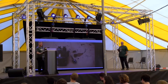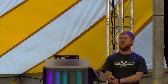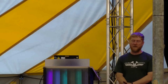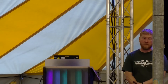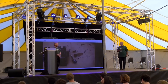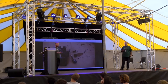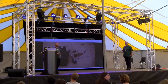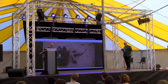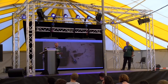Just one regarding the electric motorcycle again. Since you looked a lot into regulations, how hard would it be to make a motorcycle like this from scratch, but with an electrical engine instead? If you make it from scratch, certainly in the UK, I think it's obviously different in every country. But in the UK, there's something called the MSVA. Because of international regulations, everything has to conform to everything else. About 15 years ago, all the kit cars and self-builds had to be regulated. They brought out this single vehicle approval scheme, which an electric vehicle will have to pass, and in it is a section on the specifics that you need to have checked for an electric vehicle. So there is no real difference